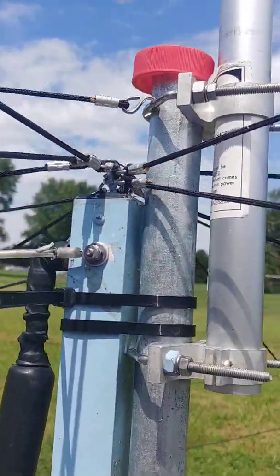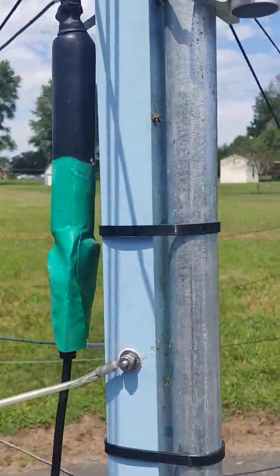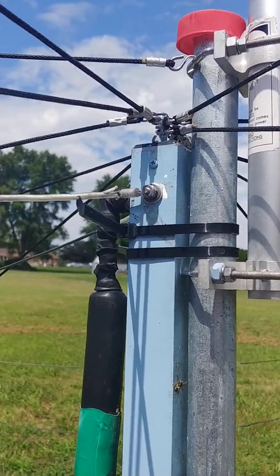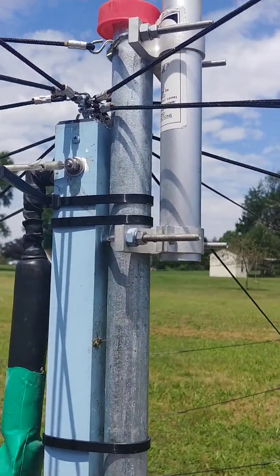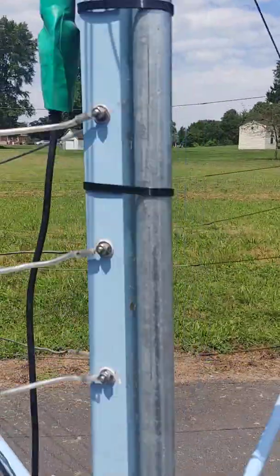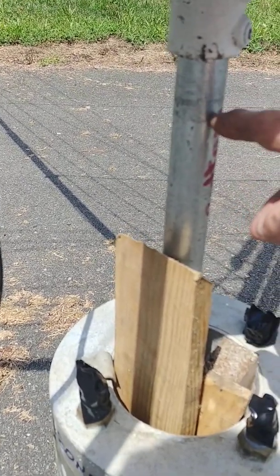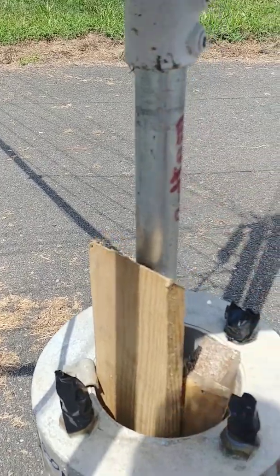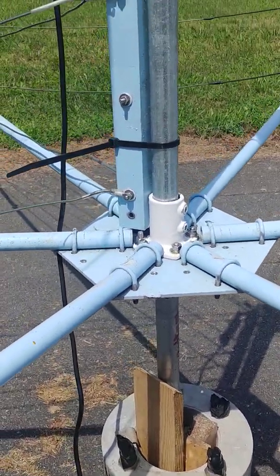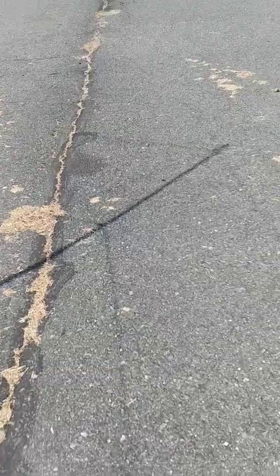The top is conventional where you have all the little spreader tensioners holding onto it. The coax comes up and is fed — I have a choke there. This will be where I put my vertical antenna, which will sit on top of this mast. I was going to put a two meter Yagi up here but decided not to, so the Yagi will be mounted on this mast down here, about 30 inches from the ground. That'll leave room for the mast to go into the socket. This pipe is threaded on the end — it's original EMT rigid pipe thread — and it'll screw into the socket I made.